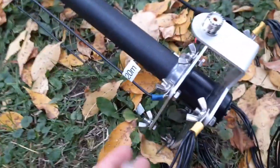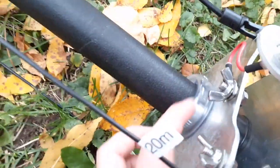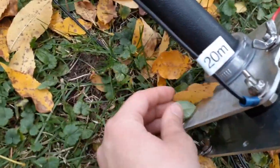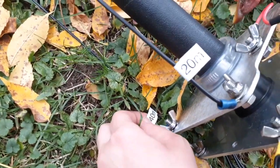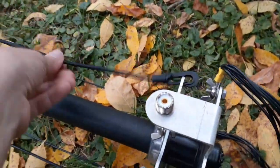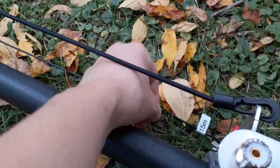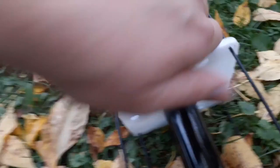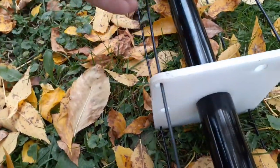When you're done and the antenna is spread out, those radials are all going to go along the bottom. Here you can see the next plate up — this is where all of the elements themselves are attached. I have my 20 meters, my 40, which goes up and back down — that's the black clip you can see there — and the 15 meters. That's also where the SO239 attaches to the bottom plate. This is the plate for the guy wires, the first plastic plate along the pole, and you can see I have all four of my wires going through there.